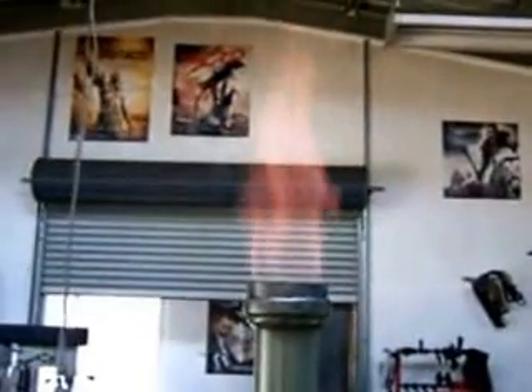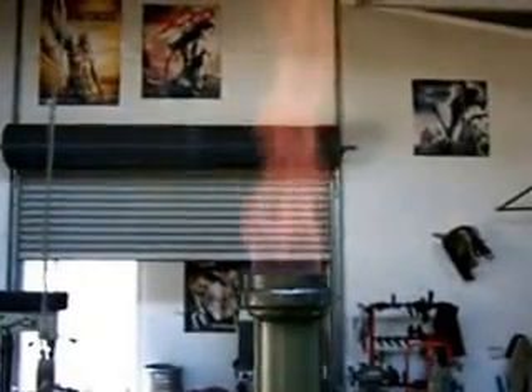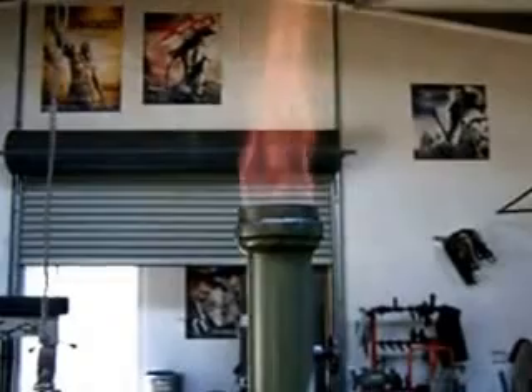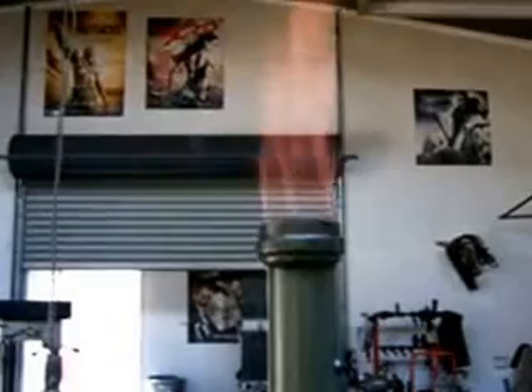Once I get that filter system sorted and get a nice clean gas — it's fairly clean already. You can see it's almost see-through, very purple in colour against that black roller there. The gasifier needs to warm up a lot I think in order to get it cleaner, but the filters do make a big difference. It's still got an orange tinge in it. The next step would be to get the generator and try the gas through it once I get the filter situation sorted.